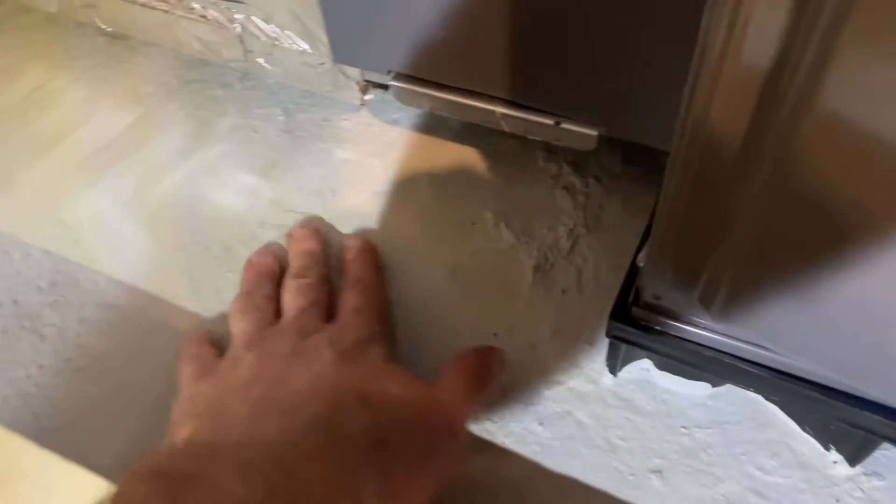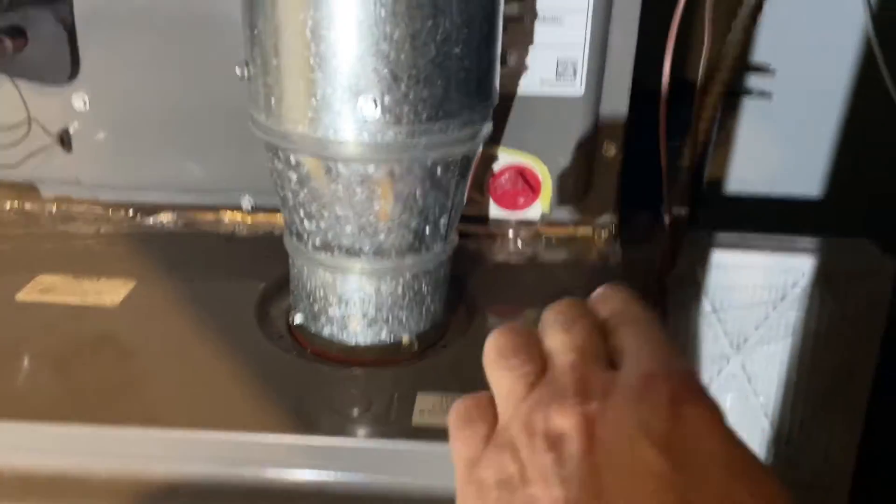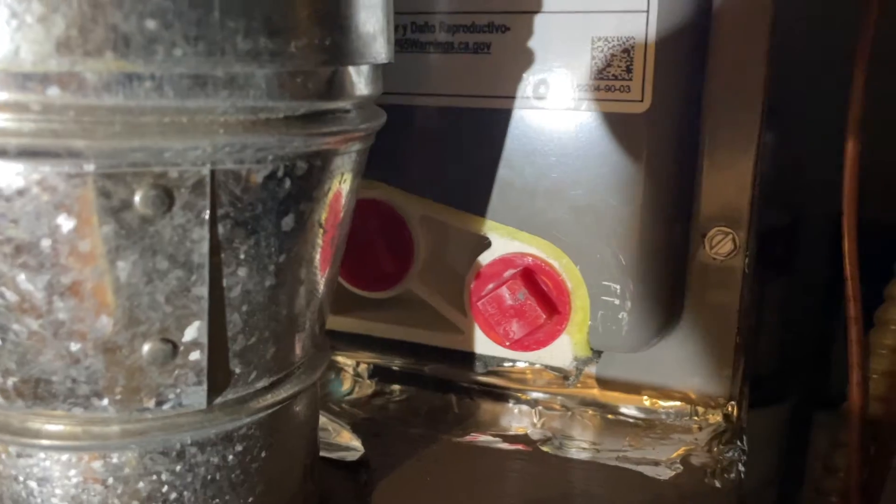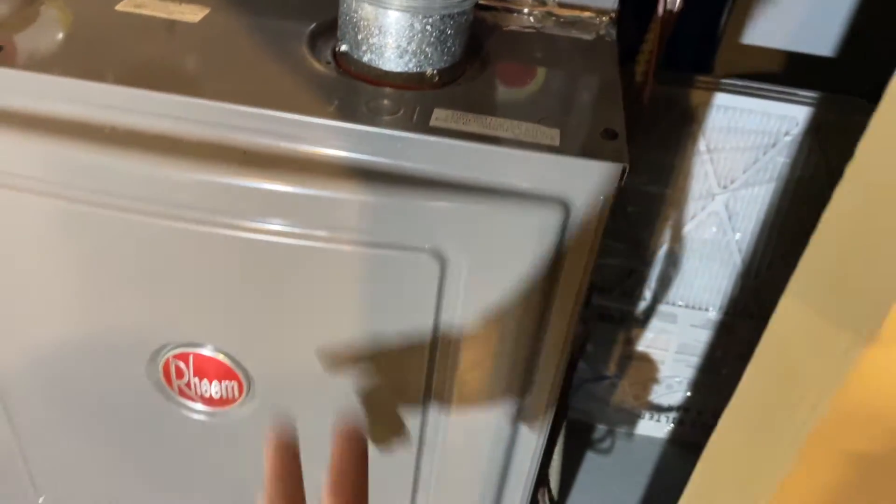This is where I was seeing water — it's basically coming from the filter housing. As you can see, it's wet on the bottom, just leaking down. We'll probably have to change that out. The drain line should have been installed right here at the lowest point. There are two outlets — we can leave the top one alone, that's already sealed. If it's open you do have to cap it. The bottom one is where we're going to install the piping and run it down. Just make sure you don't run it in front of the door because you need to be able to remove the front panels.